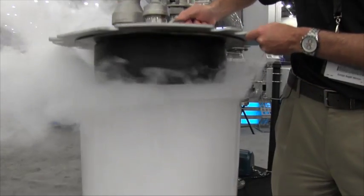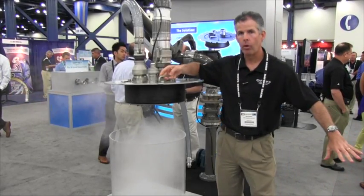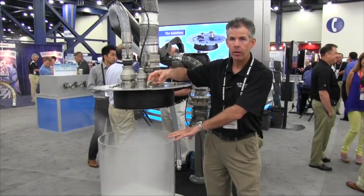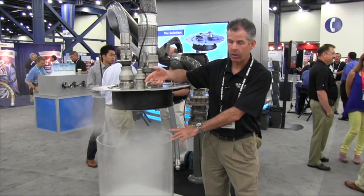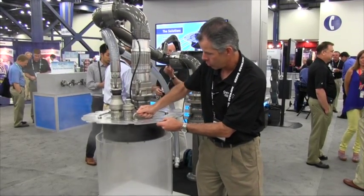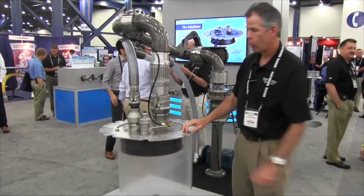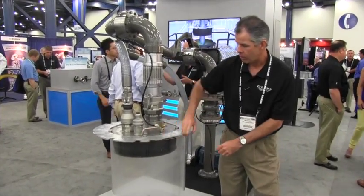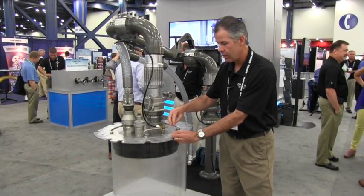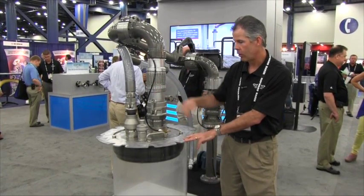This arm would be stored up against the platform, and when the tank truck or rail car comes in, we have a standard 20-inch rail car hatch or tank truck hatch. The arm would swing out and you drop it into the opening. Once it's in the opening, you can spin your lockdown ring to catch one of the hatch bolts, just to keep this from lifting out of the car during loading.